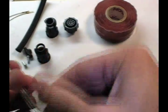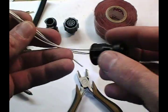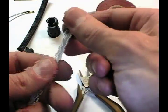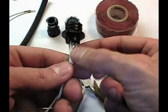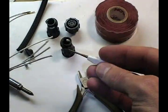One thing I forgot to mention: before loading pins, we always want to make sure we put on the connector body first. In our case we're dealing with an open harness so I can slide it over the end, but if I had done this on a bundle inside the aircraft, I'd have to pull all the pins out. Let's put the connector body on now.